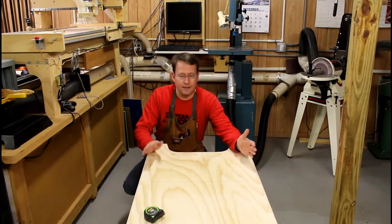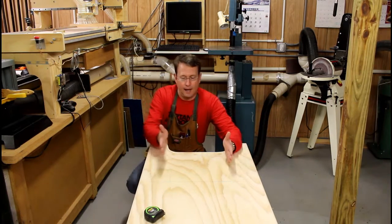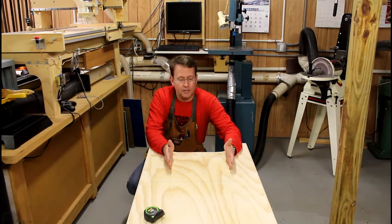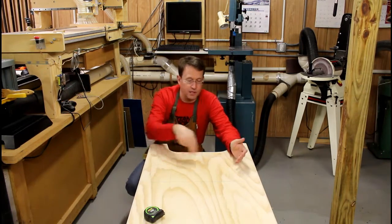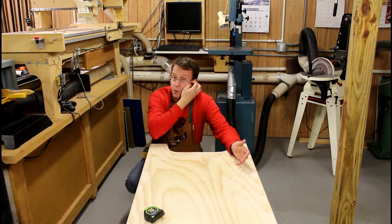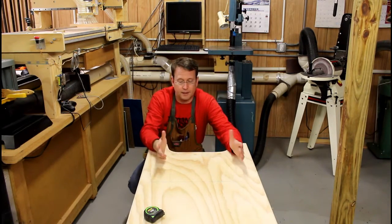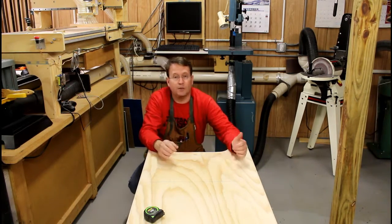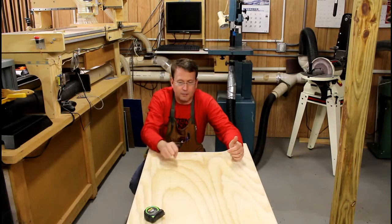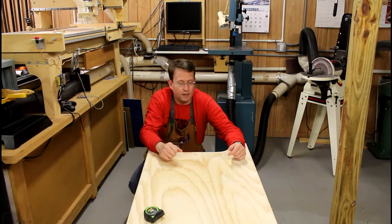We're back, and I have the side of the book box. We're going to be cutting a 12 by 12 hole in the side to allow the books to be taken out. I'll start by drilling a couple of holes in the corners and then use the jigsaw to cut it out. I've got another piece of wood a similar size that I'll cut until it fits tightly — I'll put in a piano hinge and then a lock mechanism, probably on the opposite side.